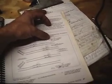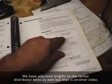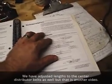Brunswick did eventually get back with me, and they said that yes, 64 inches would work. So in my service manuals, I crossed out all the 63 inches. I know you can't see it real close here. I'm not going to zoom in for that actual reason. It'll just blur out. But your left lane T-band and your right lane T-band on my green round belts, the 15 millimeters, we use 64 inches in our length. We kind of find out some of these round belts are really tight tensions, and we can get away with a lot more just giving ourselves an extra inch.